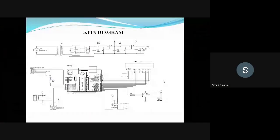A bridge rectifier is a common part of electronic circuits, sir, with DC power supply for supplying the various electronic components. It takes an AC mains supply input and gives the output as a DC supply. It is in a bridge connection, sir. So it is connected like D1, D2, D3, D4, where D1 and D2 will come in series, one after another. In this case, diodes D1 and D3 and D2, D4 are input supplied, sir.